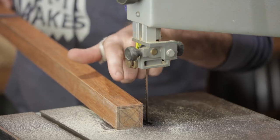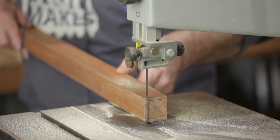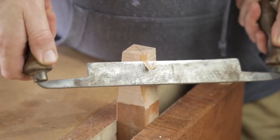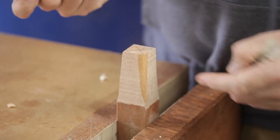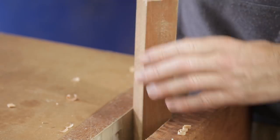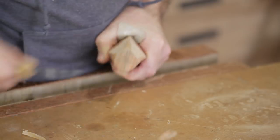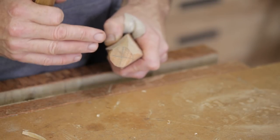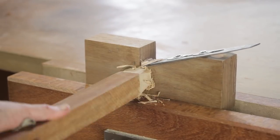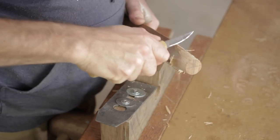I didn't take the cuts all the way through, because I didn't want to lose this piece here — it has my marks on for the base. I'm just rounding off the corners with a drawknife. The drawknife is about my favorite tool to use, but if you don't have one you can still do this with a normal knife. It doesn't need to be perfect; it's just so we can feed it into the tenon cutter. Every now and again grab your knife and take this bit of shoulder off to make the cut a bit easier and a bit neater.